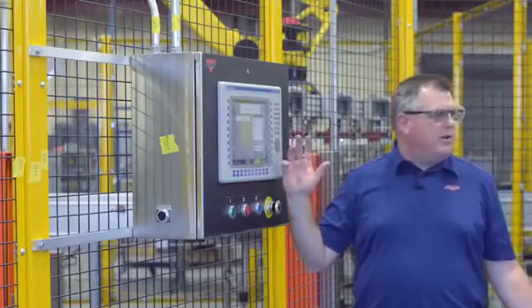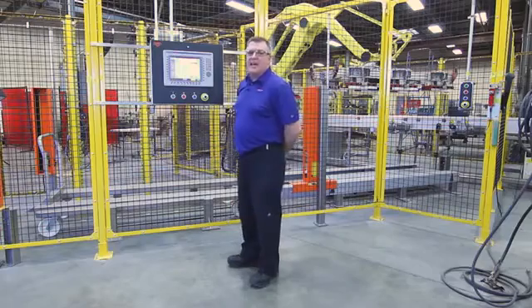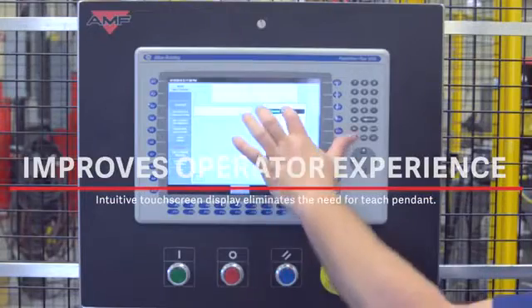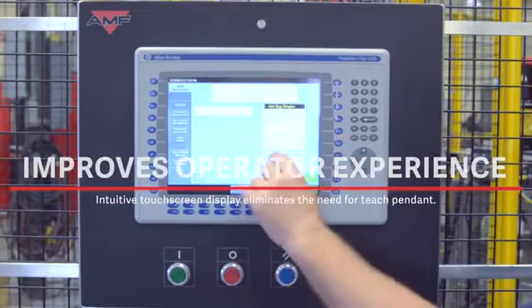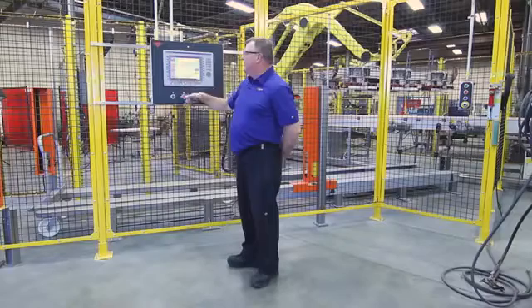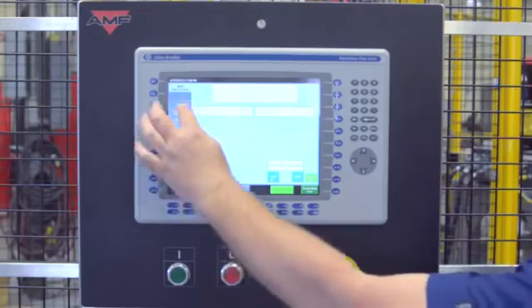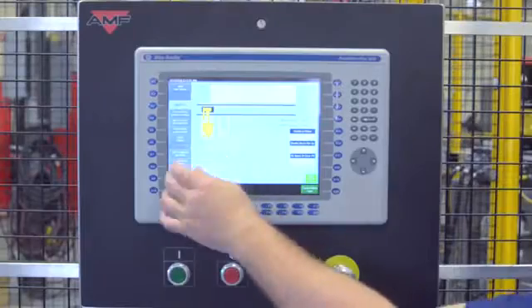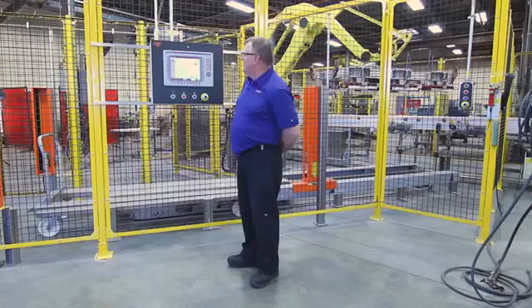There are very few controls on this robot — stop or auto. That's it, there's nothing else to do. If you want to change over, you stop the robot and then go to the shuttle screen where you have unstacked auto or stop. There's nothing to return, so it's ready to change over. You select the next pan, select auto, and she's ready to go.